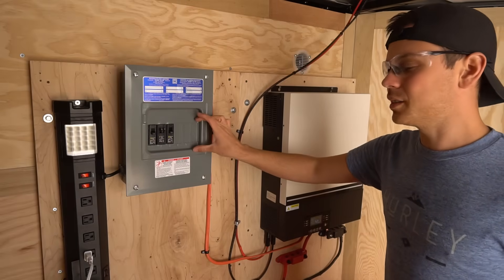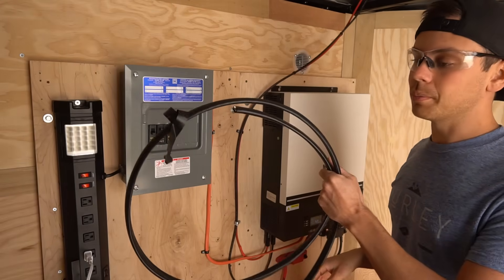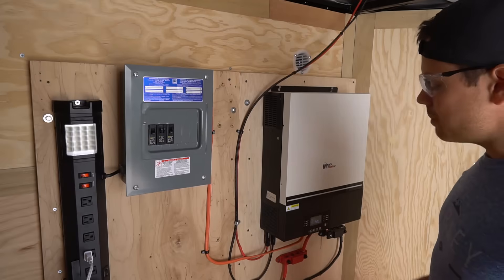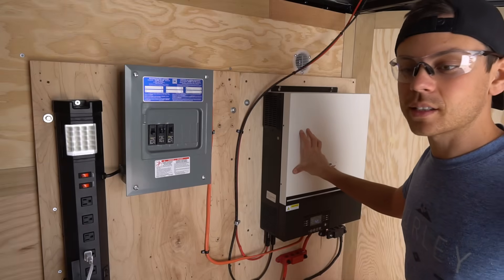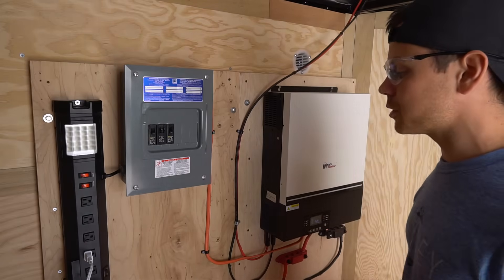I'm not going to use all of these slots though — it would exceed the output of this inverter, so this will be plenty for my use. The next thing I need to upgrade is the size of the battery. The max current rate output of this battery bank will not supply enough power for this inverter to do a max AC output. But luckily I have a large bus bar, so I can add batteries whenever I please.